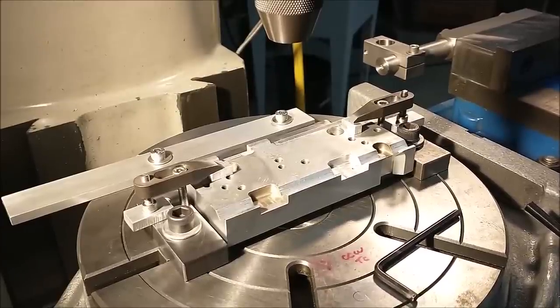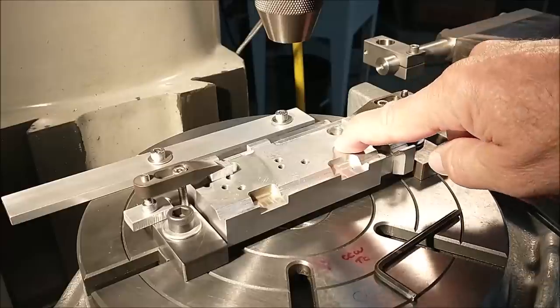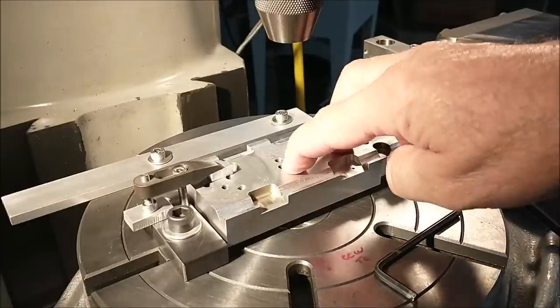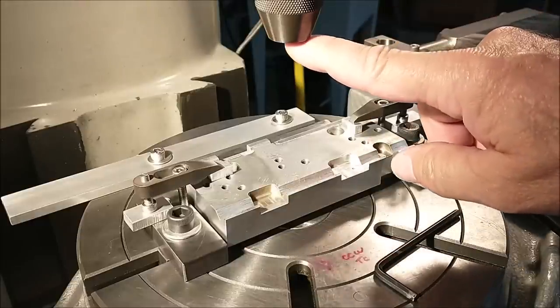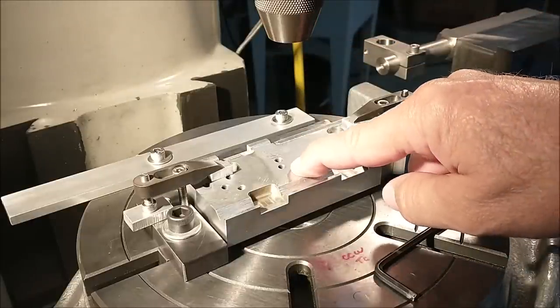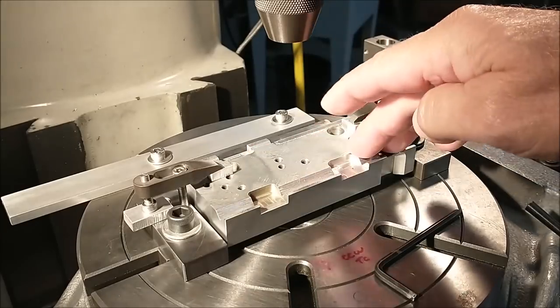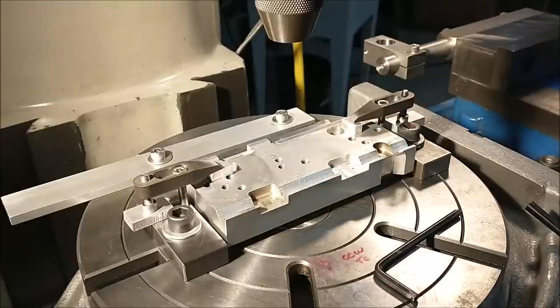The rotary table is directly under the spindle of the machine. I am going to replicate the hole pattern in the fixture plate that I just put in my parts. I will then locate the parts on pins and start the operation from there. The very first operation will be the larger hole, and that is the center. Then I'll have to shift the entire fixture plate or the part to get the other end underneath the center, so I can do the radius on both ends.